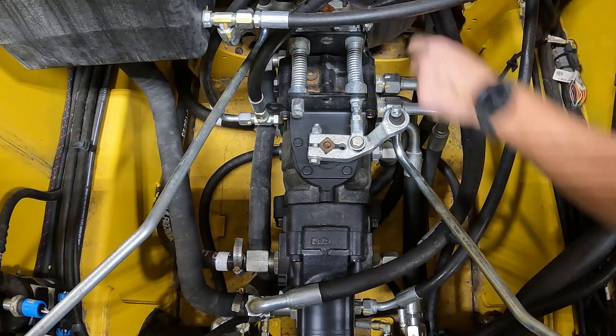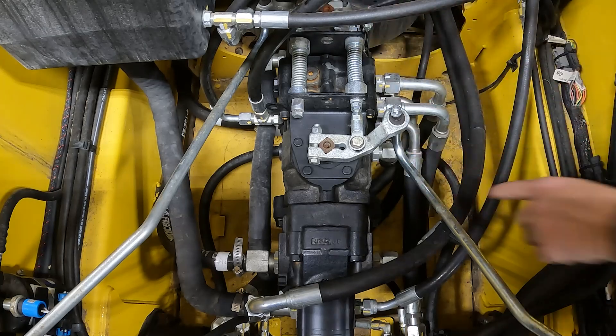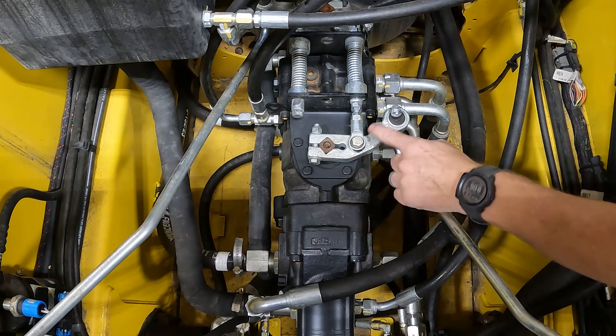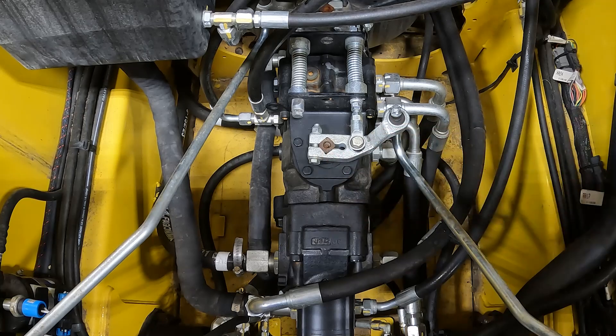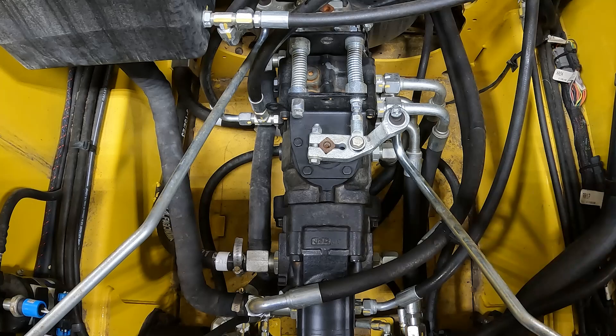The first thing we're going to remove is the two lock nuts on the drive lever to remove the linkage. The reason we do this is if you start the engine up with the cab tipped, this linkage is actually pulling on the lever on the pump and the pump is no longer in a neutral position. The engine will not have enough torque to meet the command of the hydraulic on the machine. So we're going to first remove the nuts and remove the linkage.